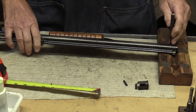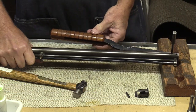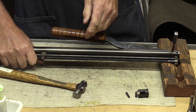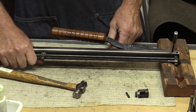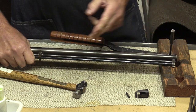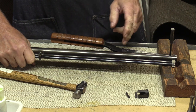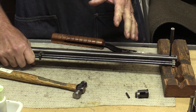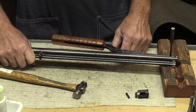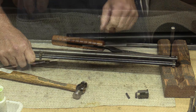I'll lengthen it out and try it until we get it just right. Well, here we are — it's bottoming out, the pump cup against the front of the compression tube. This is only with about a sixteenth of an inch adjustment in the length of that rod. So we're going to back it off a little bit, and that should make everything just about right in terms of headspace.